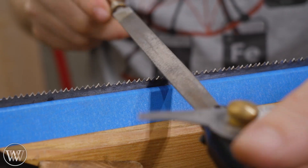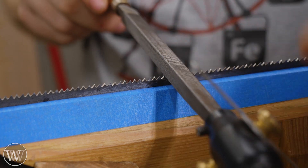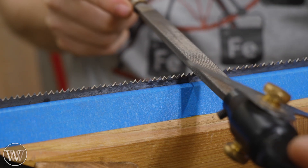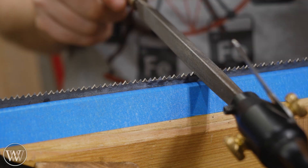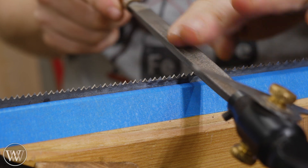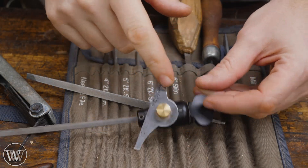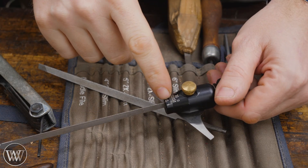The next question is how much do we roll the file? That roll is called the rake. On this particular saw, that's the toe, and back this direction is the handle. For a lot of rip saws, we'd have a rake making it aggressive so that the back edge of the file is almost vertical. For a lot of crosscuts, you want almost no rake at all and you want it flat on the top. Or if you want it to be a little aggressive, you can just roll it forward a hair. So I'm going to set up my saw filing jig to 30 degrees of fleam and about five degrees of rake on the back.